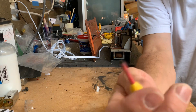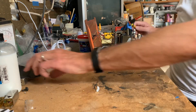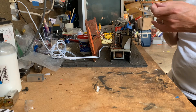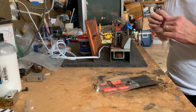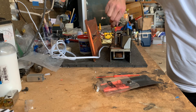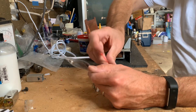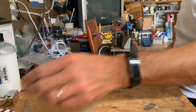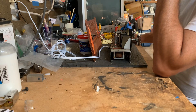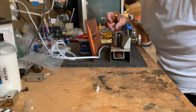I have this insulated screwdriver — just the very tip is exposed, the rest of it is heat shrink. And then I have this set of plastic alignment tools — they're not the greatest, I think they're more for TVs than anything — but you can get in here and give it a tweak. That's not how you do a proper alignment, but that's what those are for. You get it hooked up to my signal generator and give it a proper alignment. You adjust the IF cans top and bottom, and then you adjust these slugs on the tuning gang for the antenna.